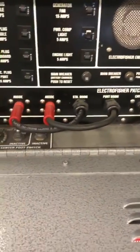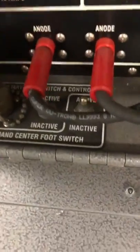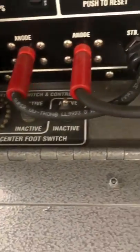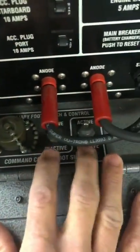There are also foot switches you can activate — active or inactive. Some cool things about electrofishing boats: the operator at the helm has a foot switch, and up front the two netters each have a foot switch. Some boats have a selector switch where you can actually turn the foot pedals on and off at the command center. It's really important to know where your foot switch settings are on your electrofishing boat.